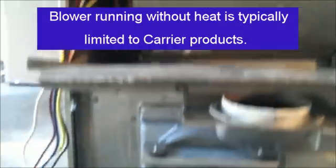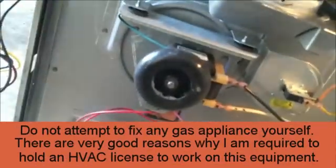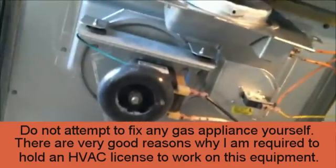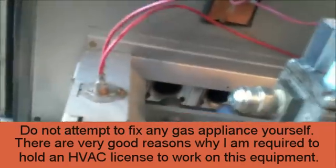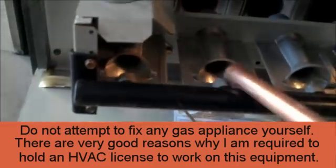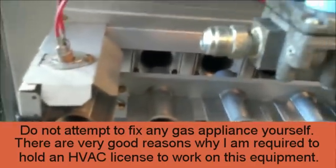That's another thing manufacturers like to do — freeze you out to make you want to fix that furnace rather than try to run it. Mode of operation: the combustion blower typically kicks on first, runs for about 90 seconds to two minutes, and then as long as the pressure switch is made, it sends that signal back to your circuit board. That initializes the hot surface igniter. Once that gets nice and red and hot, the gas valve will energize and blow gas through your jet propulsion burners — it basically looks like a little fighter jet with a nice blue flame in there.